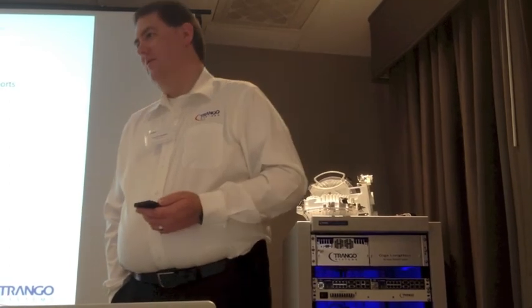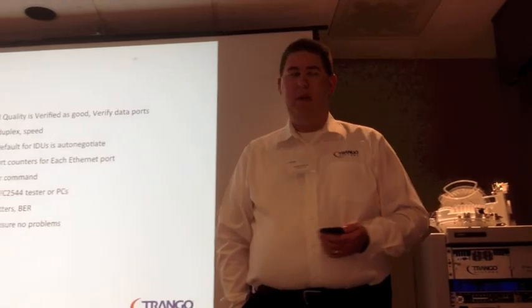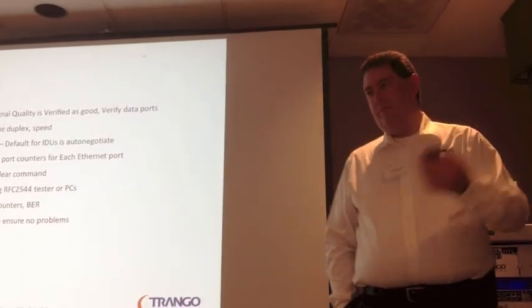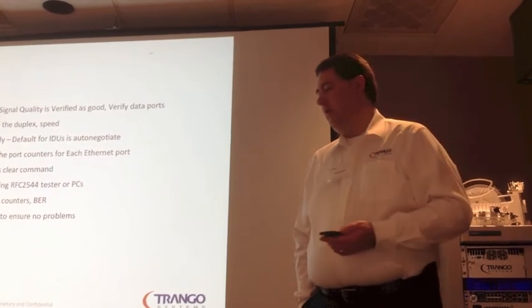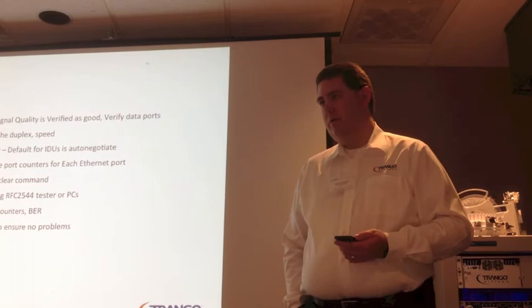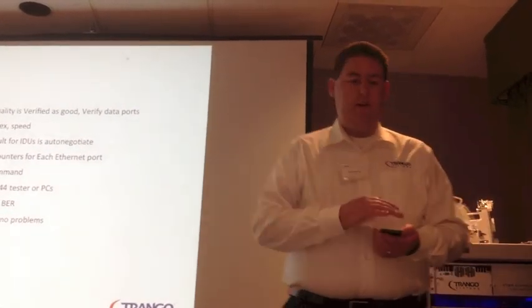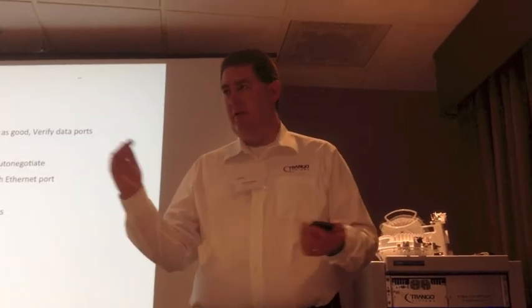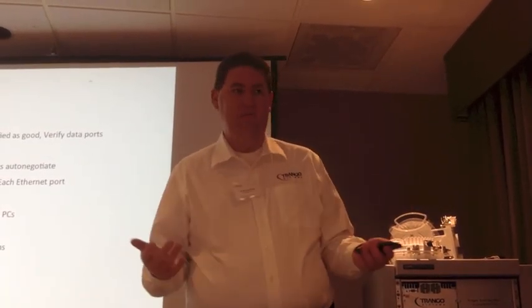Does your QoS, Layer 3 QoS, detect that and put it in front of the buffer? So the QoS would work with that and make sure that that high priority packet is expedited. We also have a relatively small buffer because there's no reason to have a large buffer in this product. We're not managing the stuff. If you've got TCP traffic that's bursting over what we can handle, it's fine. It's going to drop it. That's what it should do. Okay.